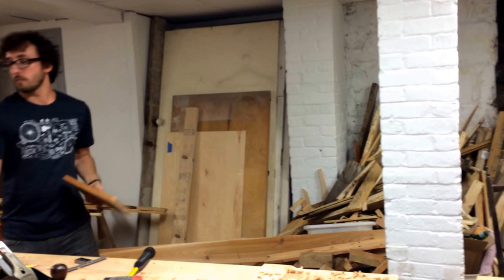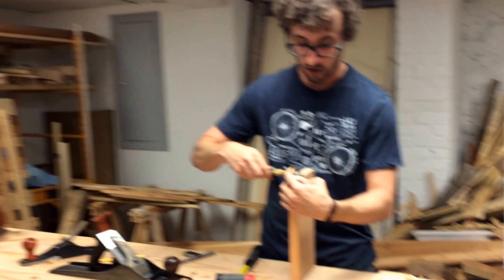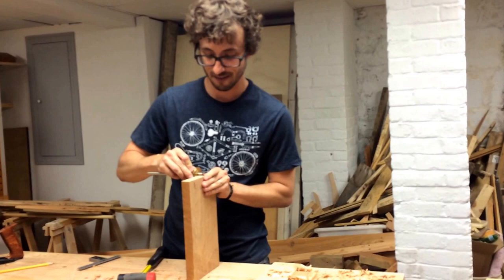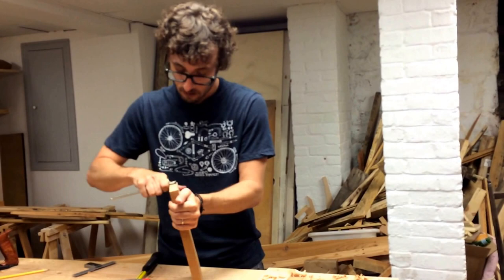And so you can take this as a marking gauge. It's just a steel rod. These little tighteners on it. You can move this up and down. It's got a little wheel. It's got a sharp edge. And what I'm going to do is try to find out where the lowest point of this board is. And that looks like that'll work. Sometimes I give myself a little room because I'm still an amateur. And it can be really hard if you can't see where you're working down to. And sometimes you just can't help taking a shape in a certain part of the board. So I give myself a little room. And then you mark it. And that will be, hopefully, where we'll try to take.